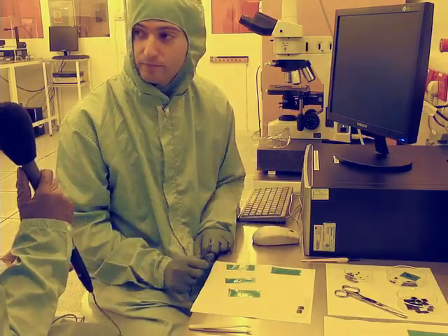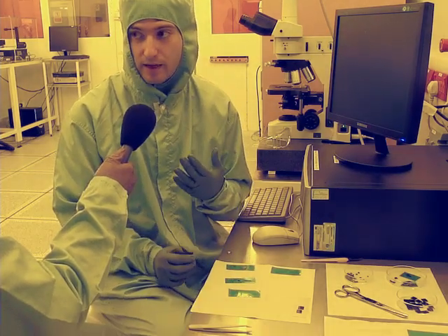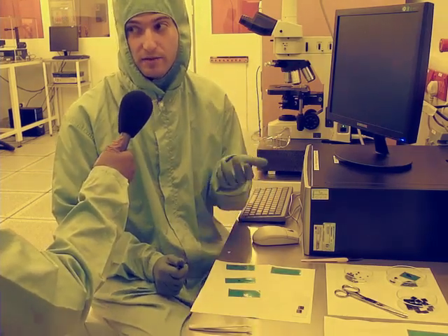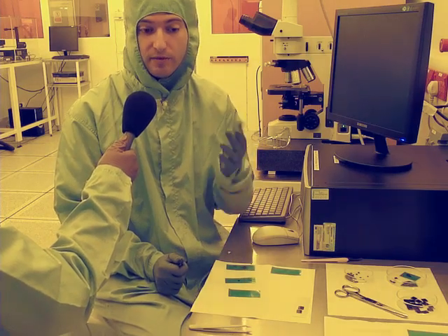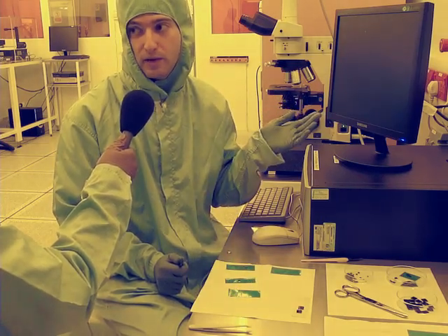Why are the chips covered in silicon dioxide? The reason is that silicon dioxide acts as a spacer, so the light goes through the graphene, through the silicon oxide, and gets reflected from the silicon surface. Because of interference, if the thickness of the silicon oxide is properly tuned, we are able to see the graphene under a simple optical microscope.